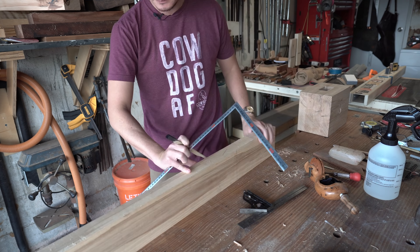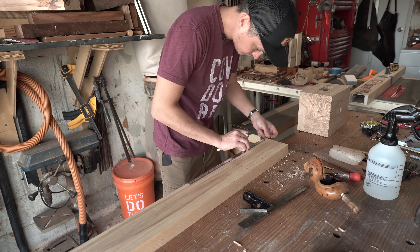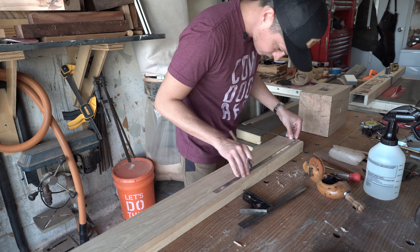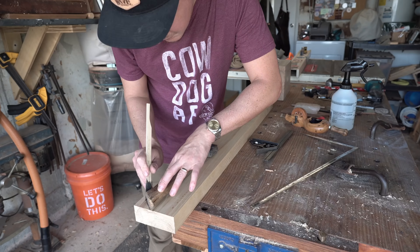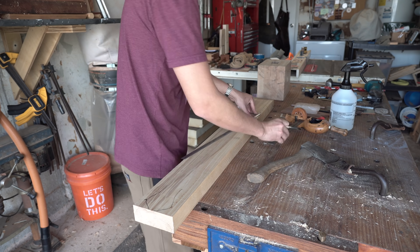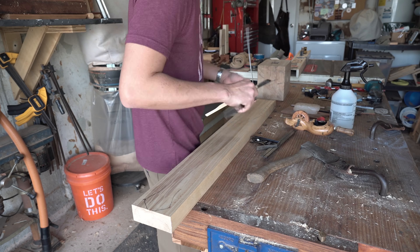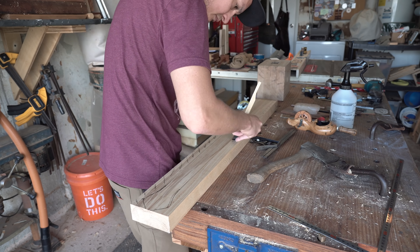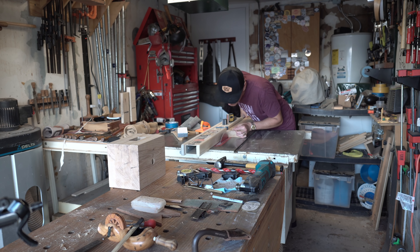The handle is also ash and I'm marking out the tenon and the respective shoulders. I didn't quite know what I wanted to do for a handle design — I'm not super imaginative in that regard — and I wanted to be able to use this mallet to both sides of the head. So I used the end of my grandfather-in-law's old hatchet to create a little detail on the end to keep it from slipping through my fingers when in use. The handle itself is about 30 inches long and I oversized the tenon in length as a just-in-case precaution.